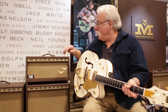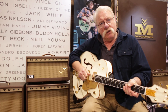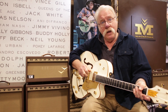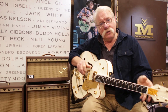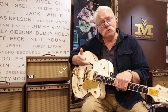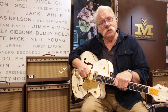These brown amplifiers — that's the traditional collection. I had quite a bit to do with the development of them. I had to fight to keep the master volume off of them, so there is no master volume. When people have a master volume, they turn it down and so now they have a buzzy preamp with a very clean power amp and you lose the output tube saturation. Needless to say, with Neil Young, we had a lot of output tube saturation because he was using a vintage '59 Tweed Deluxe.